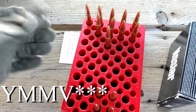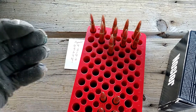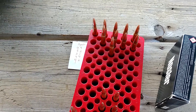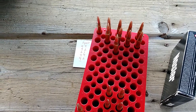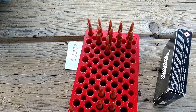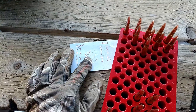As a general rule, I did not notice that seating the bullets helped with case neck runout. I just went down and in general the numbers were pretty much the same — if there was a change, it wasn't appreciably so. I don't worry too much about runout. When we get to four thousandths there's something notable, but we're going to shoot them and see how things do.